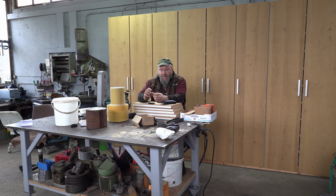Now some of these came loose during the cutting process, or at the end of the cutting process I should say, and have a small burr on the edge of them, and so we're going to wind up taking them to the sander here just to take that burr off, and then later put a small bevel on the outer perimeter of the piece. So anyway,